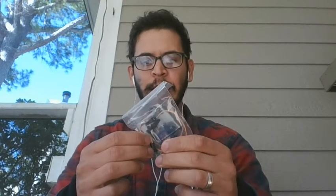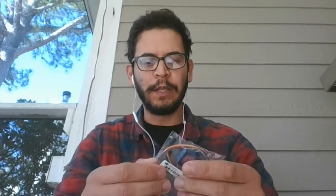We've also thrown in a small micro servo. A servo basically has three pins: power, ground, and signal. The signal wire, which in this case is orange, is a PWM signal — a square wave that goes from zero to five volts at some duty cycle. We also include some control horns with the servo. If you've ever seen RC aircraft videos with ailerons and elevators moving, a servo is what moves those things. Your Circuit Playground can control it.